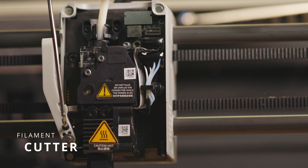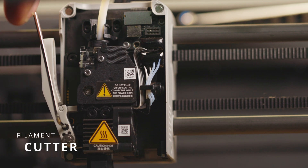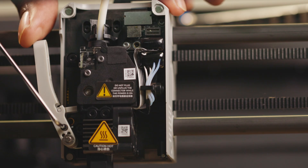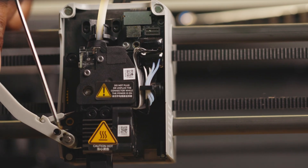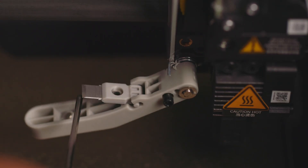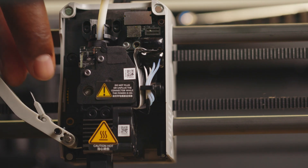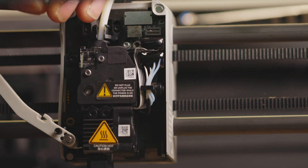Now that we've cleaned that section, we move on to the filament cutter. It's important that we inspect this thoroughly — it is responsible for cutting the filament during each filament swap. To inspect or remove it, you just remove a nut; it has a spring tensioner, you move it back and then you're able to inspect the filament cutter to determine whether it is good or not. To replace, simply slide out and put right back in, then do everything in reverse.